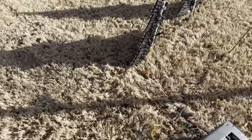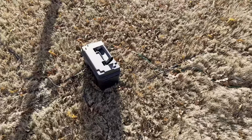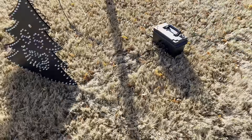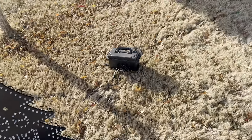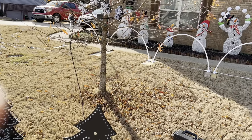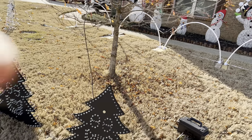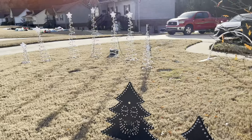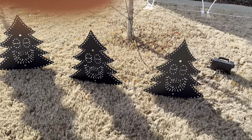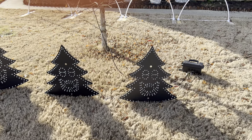Let's see. We just got a little 4-port differential receiver running from the K32 with Ethernet. I don't really like differentials. Just had a lot of data issues with them out here. They don't seem to like it when you string multiple props together, even though you're well within your pixel limit for that port. Whatever.